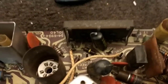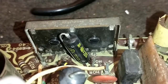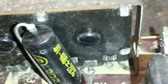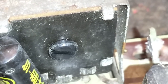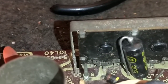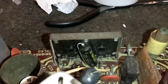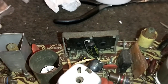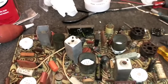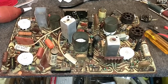This doesn't appear to have any tin whiskers on it at first — just zooming way in here. It does — it's got the little fuzzies. So I'm probably going to have to take this out, very carefully take it apart and clean it. At the very least, paint the housing so that the little tin whiskers don't propagate into the potentiometers and cause all sorts of fun. But so far we're doing pretty good here. Now it's just a matter of checking over resistors, replacing caps, etc.